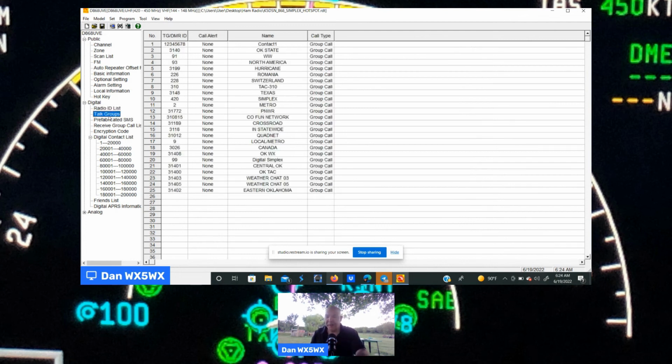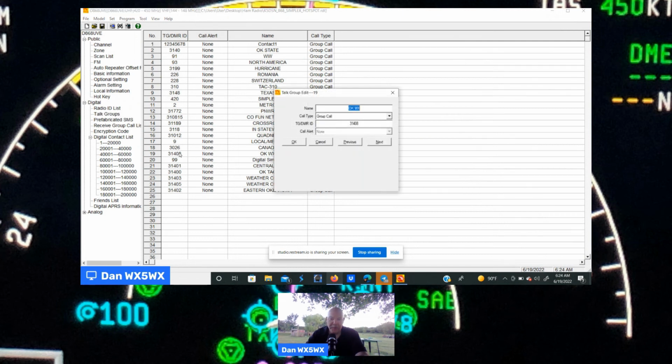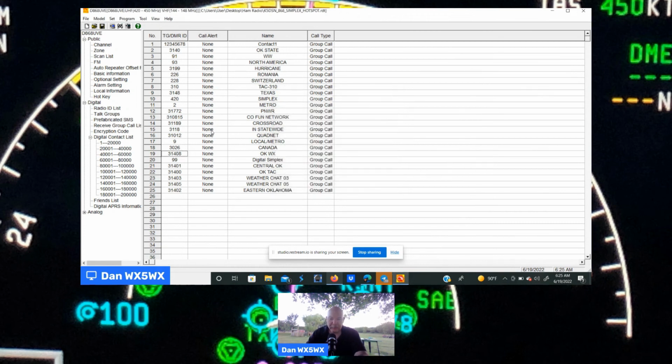Talk groups. We've talked about talk groups. You have to manually put in every talk group that you want to be able to use. So I have Oklahoma weather in here. So what you do is you click on it, name it what you want. For talk groups, it's going to be group call. Group call, not private. Private is set up if you're wanting an individual only. Then you would type in the ID of that particular talk group, which in this case is 31408. And you would do that with every one that you want to be able to use. And that allows you to have the option of selecting it when you're programming the channel. Okay.